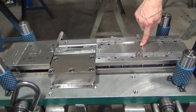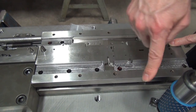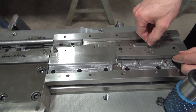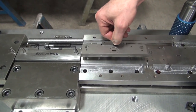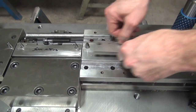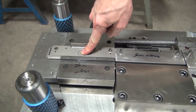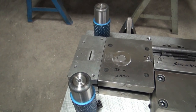You can see the punches down through here. Here's our pilot pierce — these are round pierce punches. Here's that shape punch that created a punch on the other end, piercing out the shape as this part moves through. Here's doing the other side, and you can see the pilot — as the material comes down, this cone nose is going to pick up on that part and locate it. As we get here it's piercing on both of these and forming. As we get to this last station it's going to do the semi-pierce, and here's finally that cut off — and in this case the part would fall away and fall off the die.